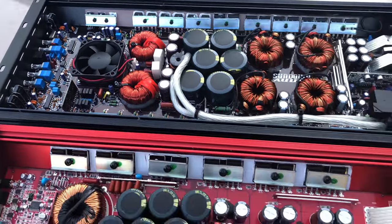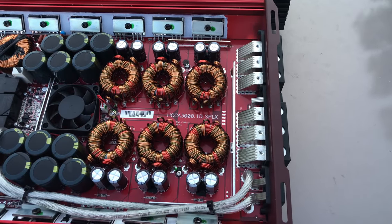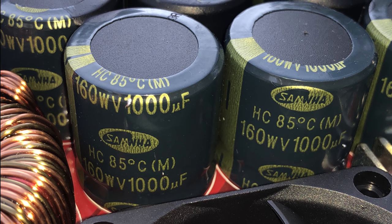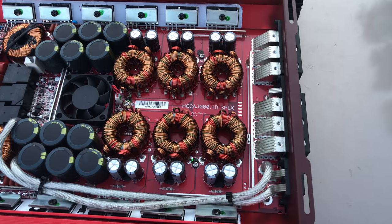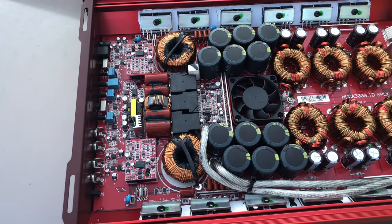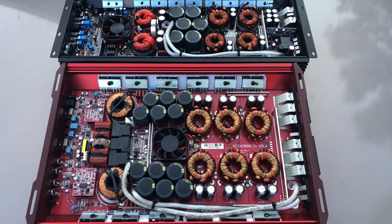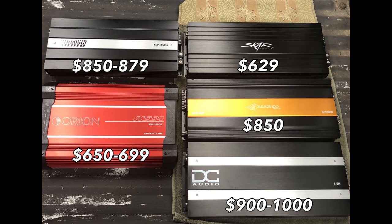The Orion has six power transformers and 12 of these 1000-microfarad, 160-volt, 85-degrees-Celsius caps, as well as 35-volt, 220-microfarad caps for power supply filtering. Just massive. The fan never came on the Orion either — so both amps are designed to run all day long with these loads. But the Orion is just way more powerful than the Sundown.